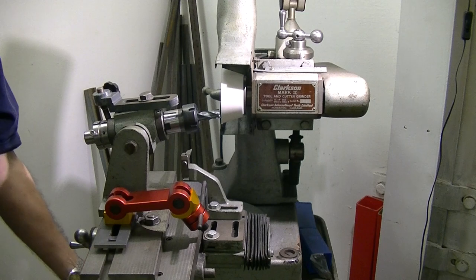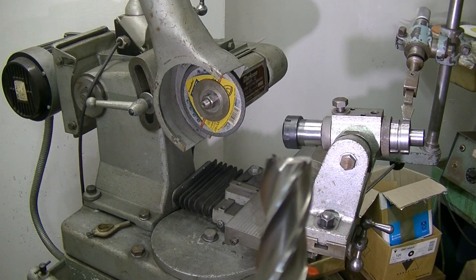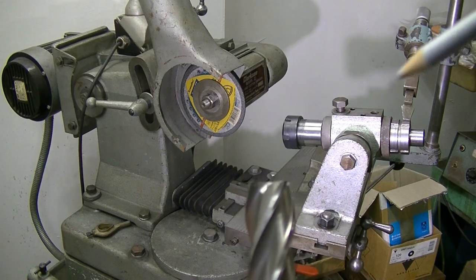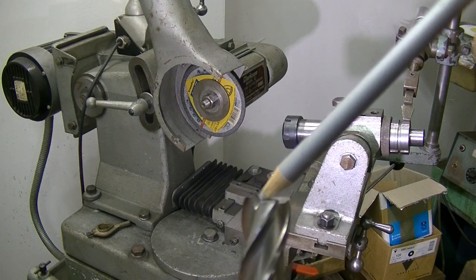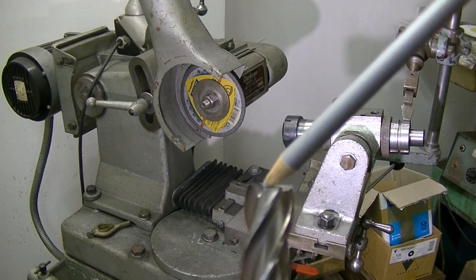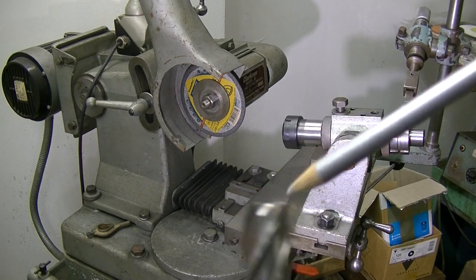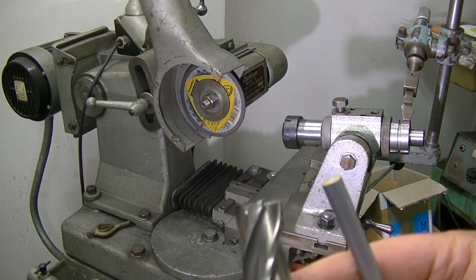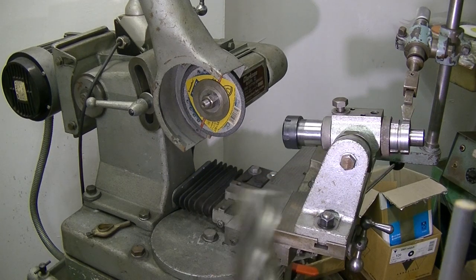I think that will do it. It's done quite a flash job even though it's a reinforced cut-off wheel for stainless steel. You can see it's nice and bright in the gullet there. I think I've taken it down enough to re-grind the cutting edge clearance. It has one badly dinged tooth just there — we'll put that up later into the workhead.